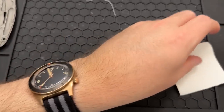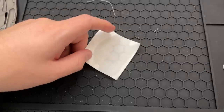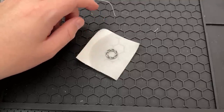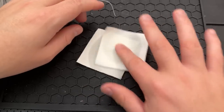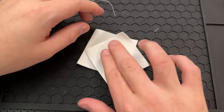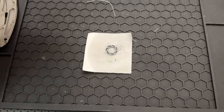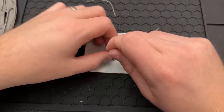Next thing I'm going to do is deal with this set of bearings over here. So, to start with, let me boozify that real quick and lift this whole thing over here. And let me boozify another cloth swatch. 21 minutes in. All right. Then we ain't even out of the danger zone yet. Okay. Well, we're definitely cleaning some off already, right? This isn't a bad approach to doing this, but it's also not a great approach. So again, what I'm going to do is use my spring bar tool here and start popping these guys through. Yeah, there was definitely some oil on there.